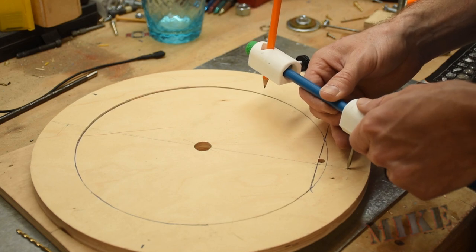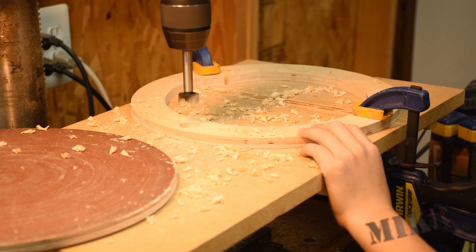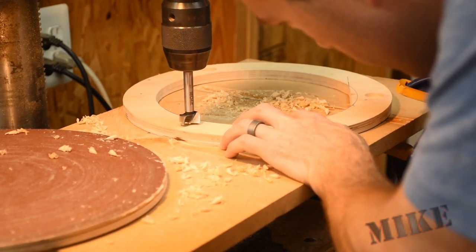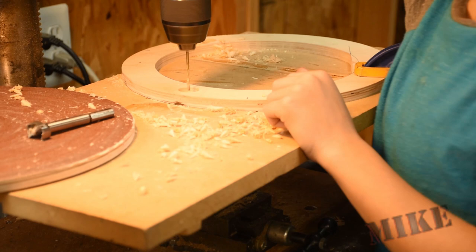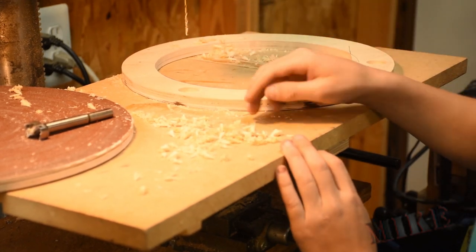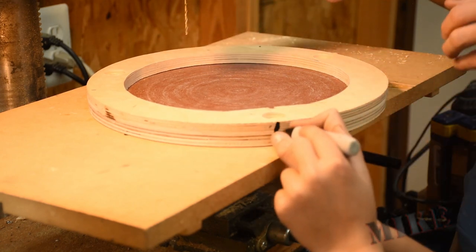Using an old trick here, we're marking three little spots where we need to drill. Using this Forstner bit, we're boring halfway through this top ring and stopping right there. We're only drilling three holes because we want this to be as open as possible — we're not putting in solid walls. Alex thought pillars would be a good idea, and I think he's right. Now we use a tiny bit to locate these holes for when we drill the pillar holes into the bottom. We're using tiny drill bits in the tips of the Forstner bit so we can see where this is going to go, because otherwise we might not align these properly. Alex is making an index mark so we can realign it, because there are three possible ways it could go and only one of them is right.